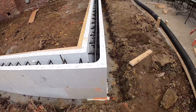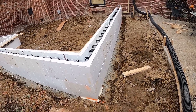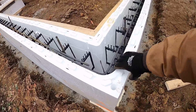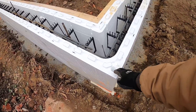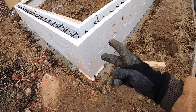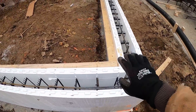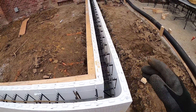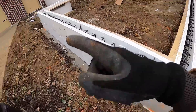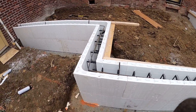I wanted to walk through the differences between Fox Block and NuDura. You've seen on my channel that I quote NuDura for Dirt Perfect - I'm here to tell you this block is more rigid, the product seems to be a little more dense. But with this product, where you see the two layers - the bottom layer and the top layer - there's nothing that locks them together. So as I was trying to screw these stiff backs together, the block kept peeling up and moving, which in turn made my wall move, so I had to readjust that end numerous times. I had the corners foamed and I ripped the corners off there.